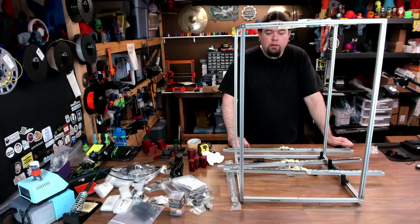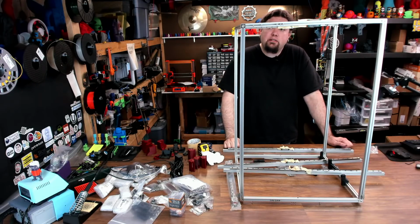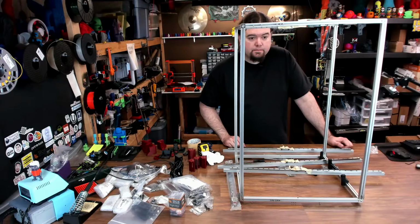For the SKR board, no. It has a bootloader. Well, I don't know that they necessarily do the same kind of thing on a 1768 chip. I'd have to confirm that. But no, you won't need to SPI connect or anything like that to flash it. It should have the access program, so when you put in that SD card, it's going to pull it in. It should be good. You just need to make sure that firmware.bin file is all lowercase and it doesn't have anything else on it. Firmware.bin.